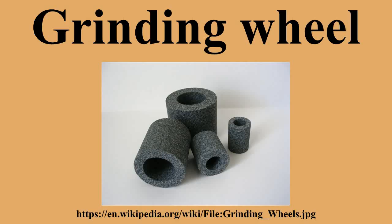Diamond wheels are grinding wheels with industrial diamonds bonded to the periphery. They are used for grinding extremely hard materials such as carbide cutting tips, gemstones, or concrete. The saw pictured to the right is a slitting saw and is designed for slicing hard materials, typically gemstones. Mounted points are small grinding wheels bonded onto a mandrel. Diamond-mounted points are tiny diamond rasps for use in a jig grinder doing profiling work in hard material. Resin and vitrified bonded mounted points with conventional grains are used for deburring applications, especially in the foundry industry.